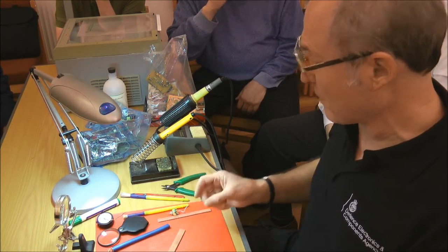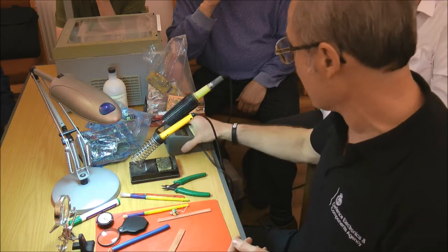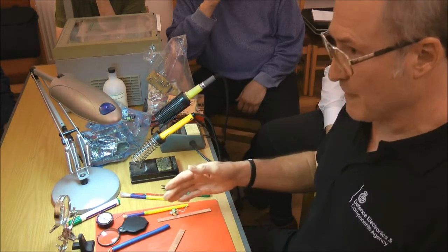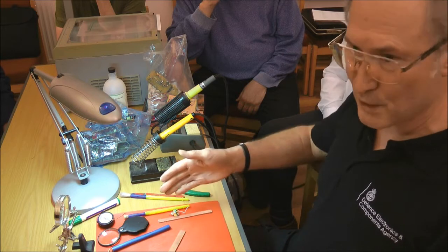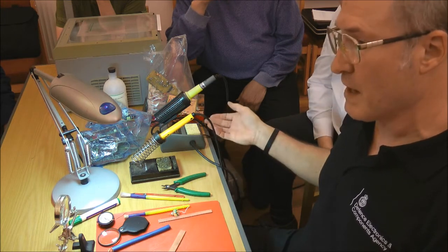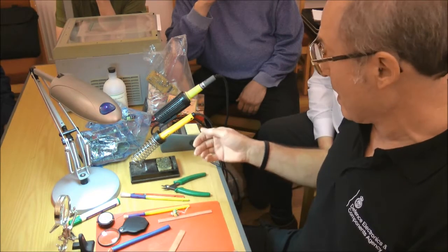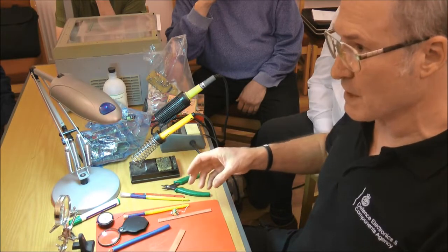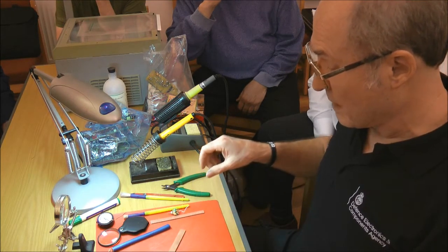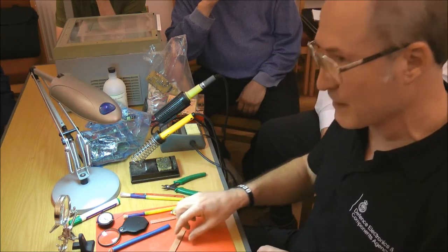Electrostatics: looking primarily at soldering, if you're soldering electrostatic devices, you can get away with using an ordinary iron. This one here I think actually has an earth termination, so you can earth the iron. You don't have to have fancy, expensive mats and things. You can get away with a sheet of baker's foil. The only thing that's recommended is you use a 1 meg resistor to earth, and similar with your iron. It's twofold: if you get something that's live, you're not going to get a lethal current that's going to kill you. And also, if there's any difference in voltage, it doesn't matter what the voltages are, as long as they balance out, if you're working with static sensitive equipment. But you want it to discharge slowly. You don't want it to suddenly put a spark across and destroy the nice integrated circuit you spent a lot of money on.